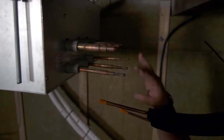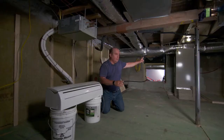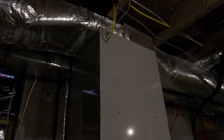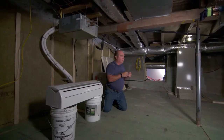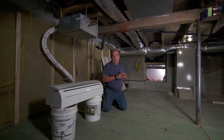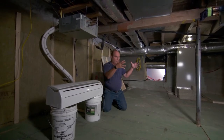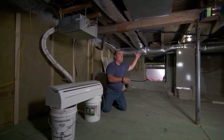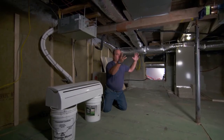What's happened with this industry is there's been ways to now deliver that comfort invisibly. Off this first set of ports, there's a series of ports — we'll have a set of refrigerant lines that go over to an air handler for the first floor. That will be much like a conventional furnace but there's no burner inside, just a really smart heating and cooling coil. You can see the ductwork delivering it to the first floor invisibly. Off the other ports we'll go to the second floor, where there'll be two really small air handlers — one on the south side, one on the north side — giving us individual zones on the top floor.